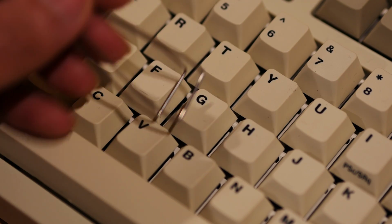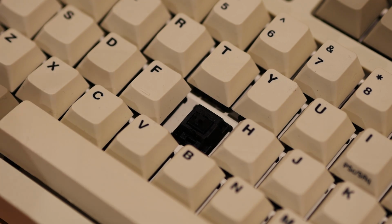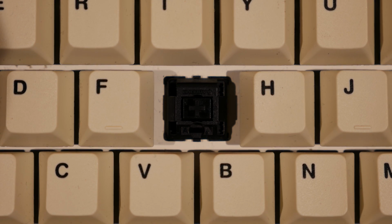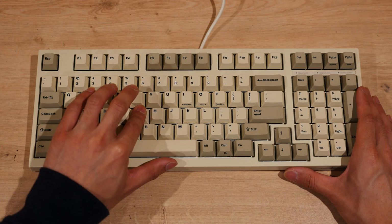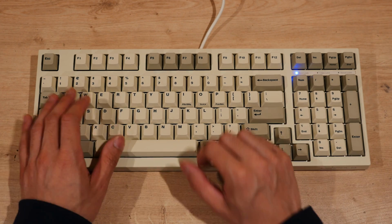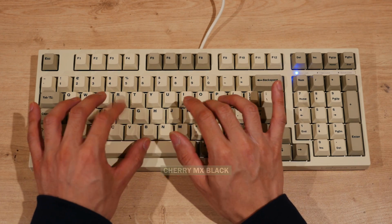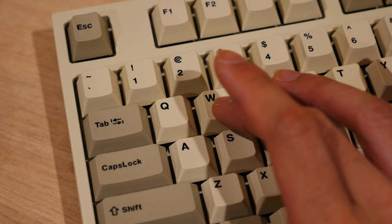So it's got the looks, layout and quality. But what hasn't it got? Under here. Leopold supplies the 980M with Cherry MX switches. Not bad per se, but better alternatives exist, especially when none of their boards are hot swappable. This one has MX Black, a heavy linear switch that exhibits audible scratchiness and a ton of pinging.